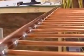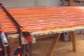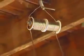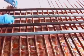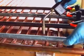Soldering headers indoors is ok, but the next step — soldering a 5-thousandths inch thick copper sheet to the copper tube — is best done outside due to the amount of smoke you will create. Press the copper sheet securely against the copper pipe. I have found 3/4-inch black iron pipe did a reasonable job. Have lots of solder available. I use 50-50 lead-based solder for this part of the project. I also use a water-based flux. This jug was good for about 3 solar panels. At this point, you can straighten the copper tubes that are wedged between the black iron pipes.